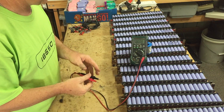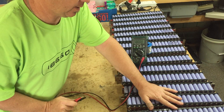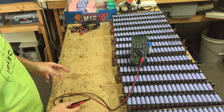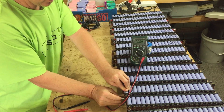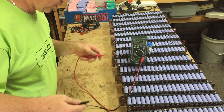Okay, we've got the bank up here now in the workshop. I'm just gonna do a quick voltage on all of these. Now I could have very easily done the voltages down in the shed but I wanted to actually show you what the voltages were. I've charged back up to 4.1 volts or close enough to it, because that's where I balanced it from originally. So let's run through each cell and see what we've got.